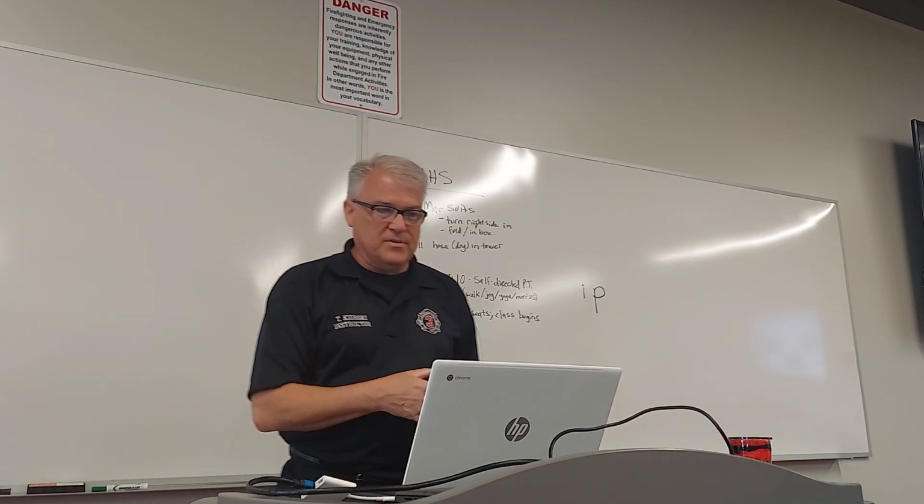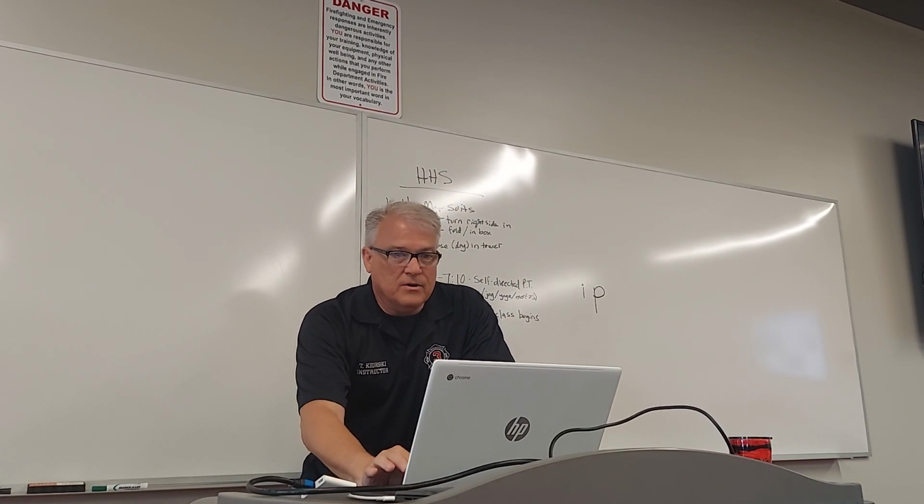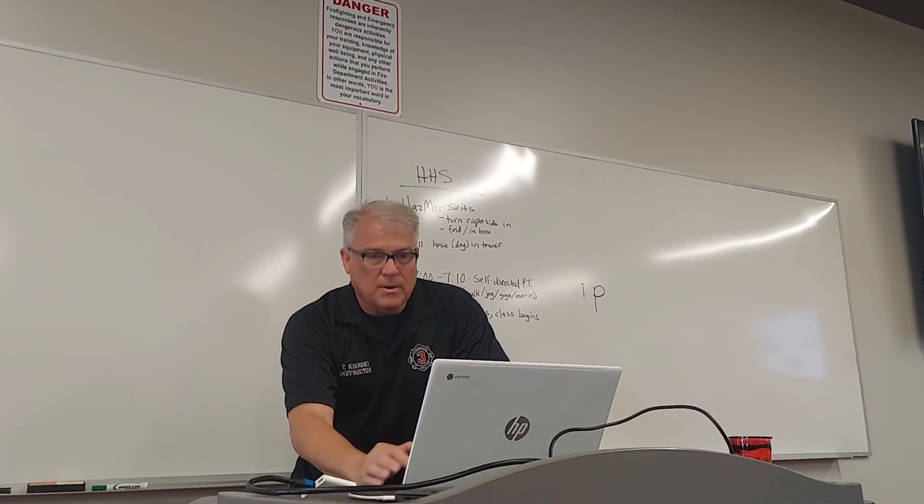So again, here's some of the things you're seeing. Fusible link, that's the one I just pointed out, and on there is going to say the temperature. It'll also say SSU, P, or S in this case. Frangible bulb heats up the liquid, it breaks. This one's a chemical pellet, so this arm and this arm are made of two separate alloys that are going to twist in opposite directions. So it'll just cause it to fail and move out of the way. You can see that the frangible bulb has a red liquid in it. You can see the frame arms here are painted red.